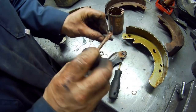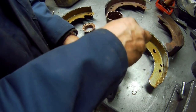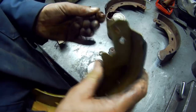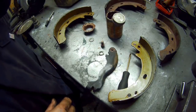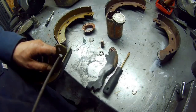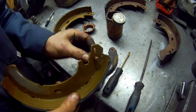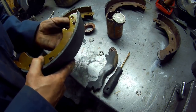So with a brush full of copper grease, grease up the parts and give them a generous daub. Make sure they all go back together nice, and make sure this goes in here because sometimes these — just like that look — it's a little bit tight. So what I'm going to do is — it'll probably be the lacquer they've put on here to protect the metal — I'm just going to get a little rat tail file and open that out a little bit. You won't have to go too far with it. There, you see? That's all it was — the lacquer. But it's best to get it off.